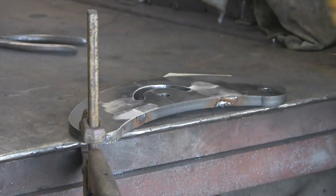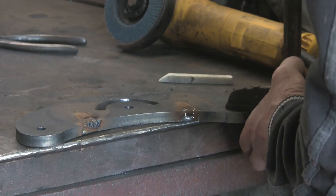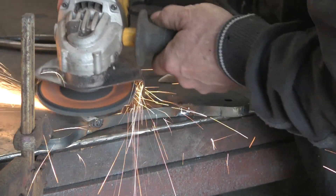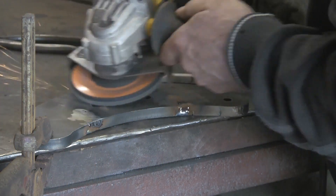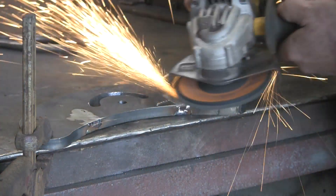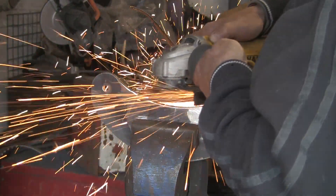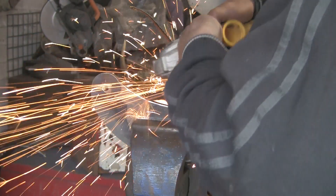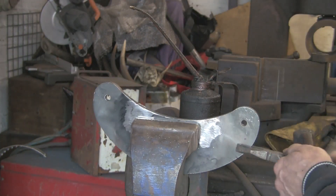You'll have the bits of angle iron in the way as well on one side, and the bolts the other side. So no, you'll never know it was all there. These things do happen when you're designing jobs. I shall alter the patterns, or the CAD drawings, and do away with those slots. I'll possibly put in a couple of small holes to use as pilot holes. You don't want to go trying to tap through laser cut holes - you'll find them very hard and you'll probably break your tap.